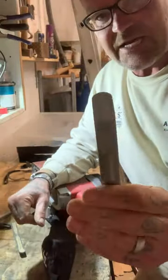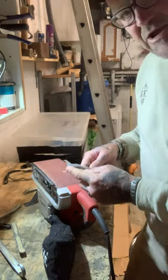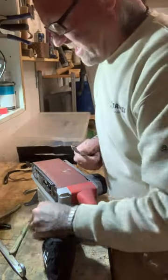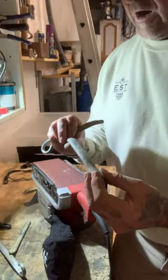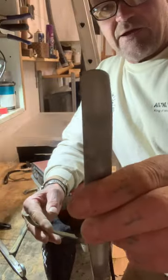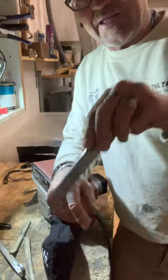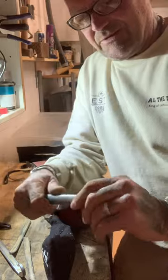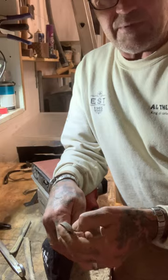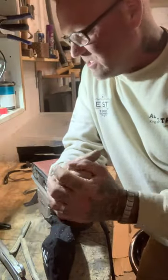This isn't finished — it needs probably another three or four minutes. When you buy them they come with that rounded shape. Once you get to the stage where they're cut down — which this one has been — I rounded it back off myself and I put the angle on that side. I have an angle there — look, that's one that hasn't been touched. I put that angle on, and then with the rounded edges here I just roll it round. It's very important to round those corners off. I've been pointing with this bucket handle too — it's got a square top, and it doesn't do the same job. You want that rounded bit. When you re-bend them, you just need about 25 mil — put that in the vice about 25 mil down and just curl it, or with a hammer if you struggle.